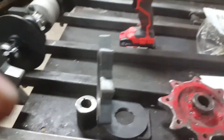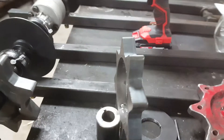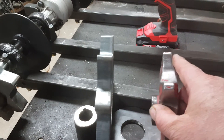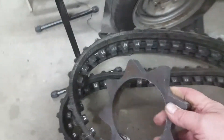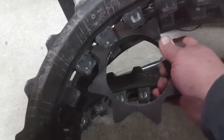The machine shop couldn't get any one-inch steel drops, but they had 7/8-inch, and I figured it'd be okay anyway since I took a grinder — actually a cutting wheel — and trimmed it down a little bit. This literally matches the inside of the track. It fits in there perfectly at almost 7/8 inches, though I'll probably still trim it down a little bit.